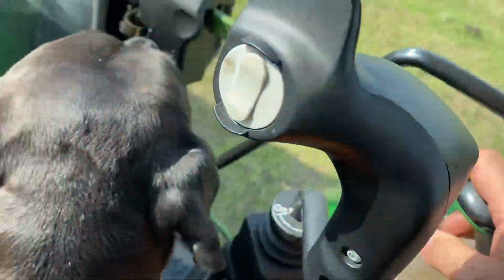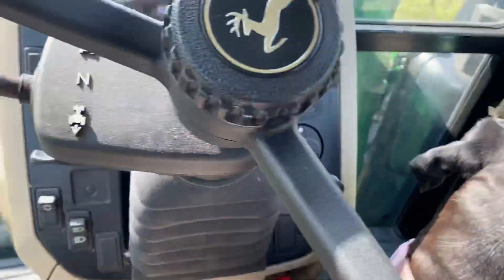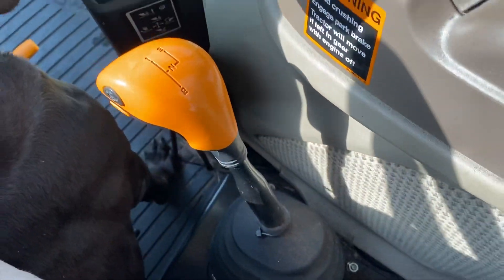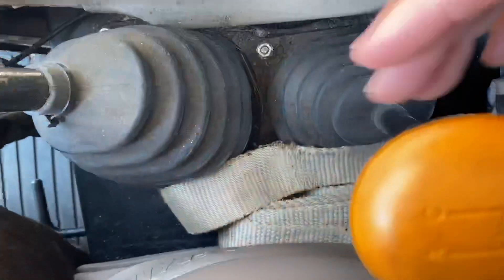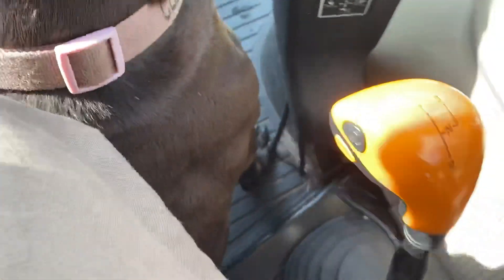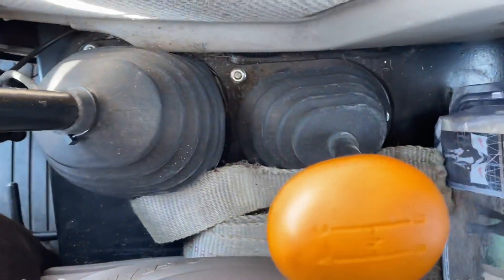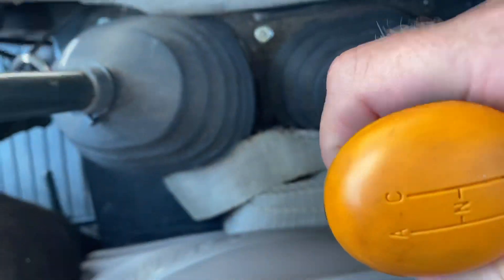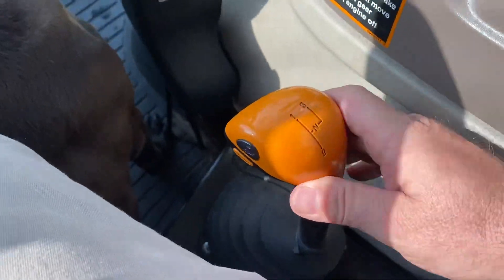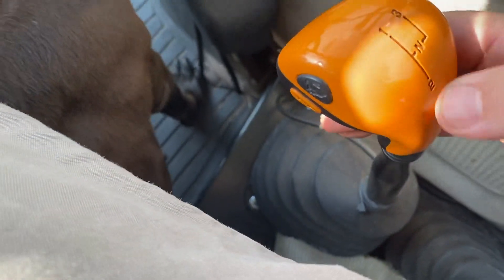Now how do we drive this thing? First off you've got a clutch, just like driving a manual transmission. It has two gear shift levers — one for high and low range on the right side, and the other is a three-speed transmission with A, B, C, and D — so it's actually 12 speeds. We're already set in range B, and I like to mow in second gear range B, depending on how rough or smooth the terrain is.